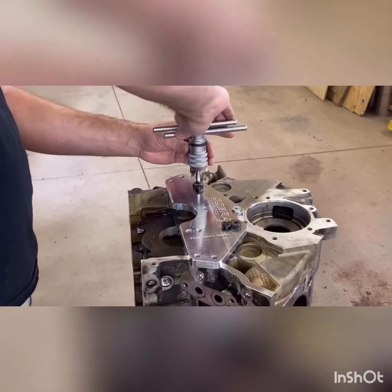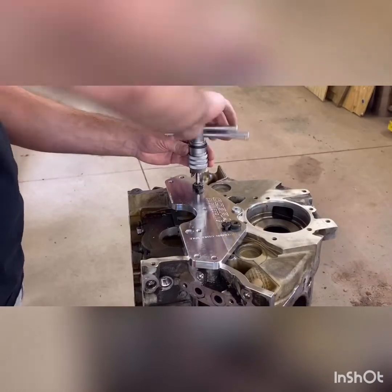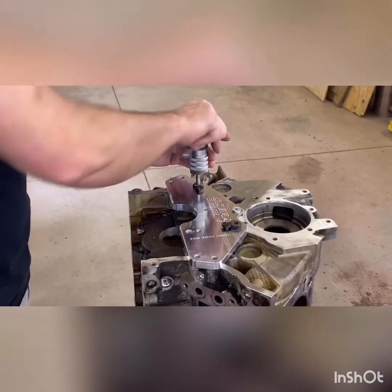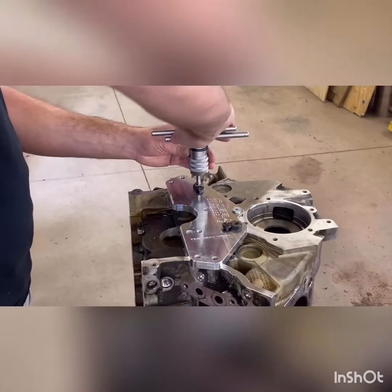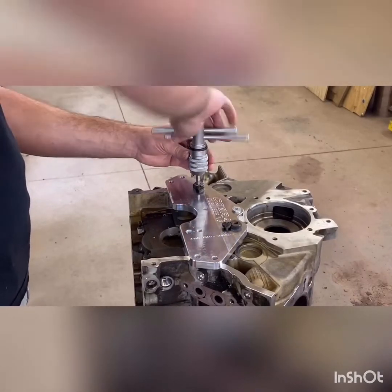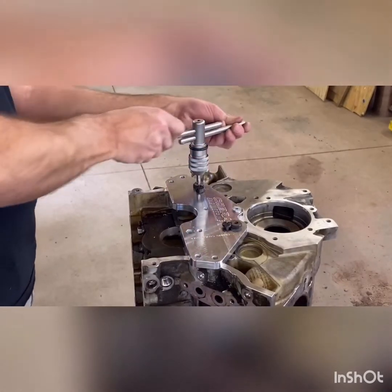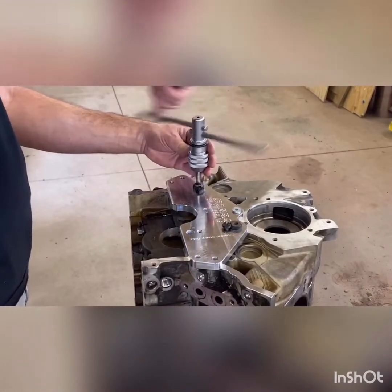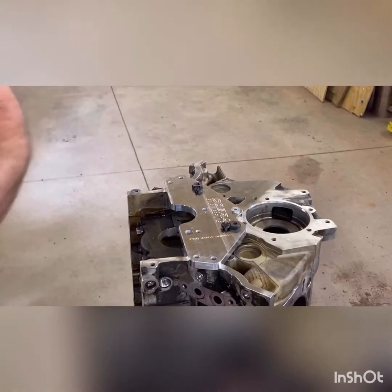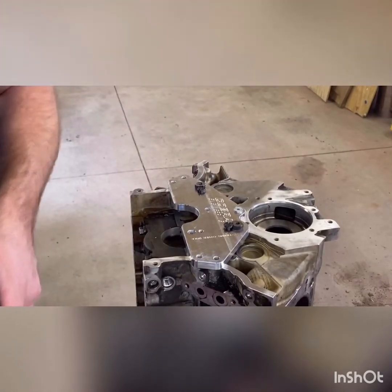Resistance is bad — taps are generally brittle; they're not as strong as a drill bit and they won't give you as much warning before they break. One of the reasons I send you a straight flute tap. We do make tap removal tools that go down in the flutes and can hopefully get it out if something bad happens. Definitely want to run it all the way to the bottom of the hole — as much engagement as possible. That's pretty good right there. Clean off the tap good; you don't want to start on the new hole with any chips on there whatsoever.